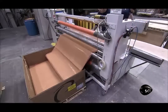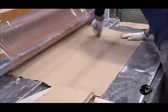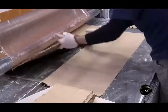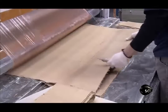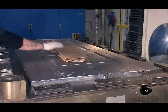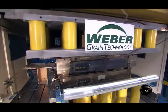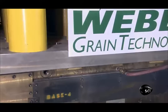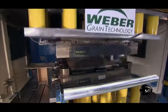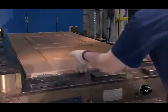The fiberglass material unwinds into a cutting station, and a worker slices it into uniform strips. A mix of resin and glass fragments, the fiberglass has a dough-like consistency at this stage. He places a stack of the strips on the nickel door mold and lowers a hot press. Applying serious force, it squeezes and melts the fiberglass, which flows into the crevices of the mold.